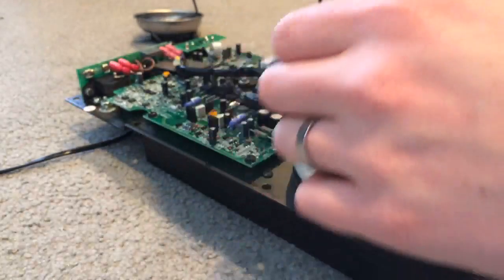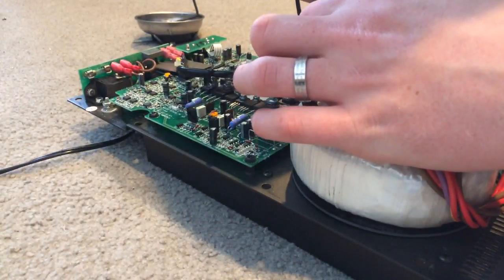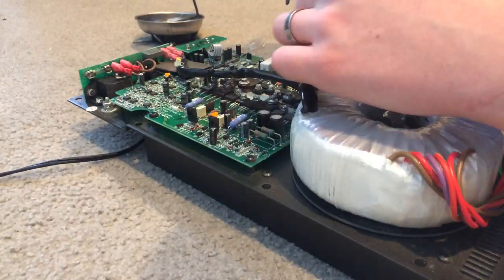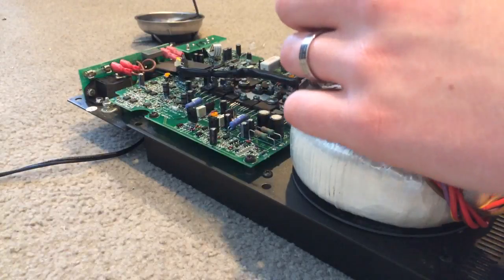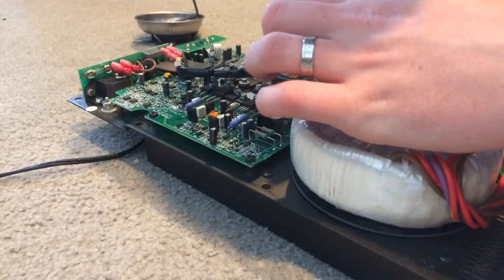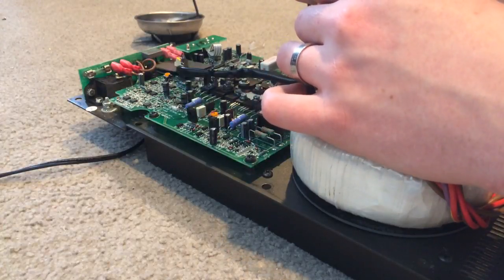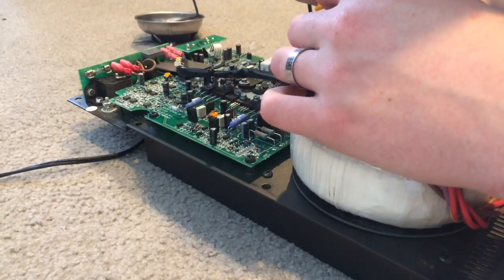These resistors are handling a lot. Now, this is going to be a tricky one — I would recommend if you've got a solder down here, just bring the board to me. If you slip your iron down here and you touch these big capacitors, or you touch that connector, or you accidentally touch the silicone of these resistors, you are in serious trouble. You're going to have to replace your resistors and the capacitor. One slip in this area and you will kill your Mackie.